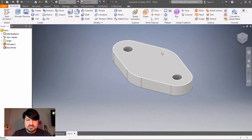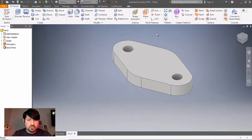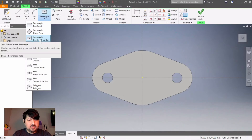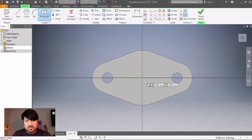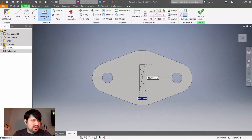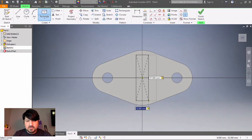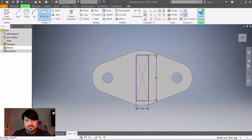In the center part there is a rectangle that shows up, and then there's a cylinder with a hole on top of that. I'm going to do this the easy way. Click Start Sketch, click on this face, and go to the Two Point Center Rectangle. Click on the center point — the thickness is 18 millimeters, Tab, then 67 millimeters length, Tab. If both of those are correct, Enter. We're done — click Finish Sketch.